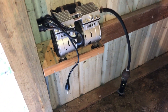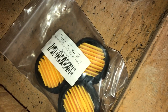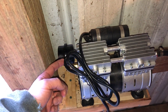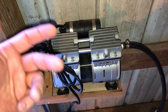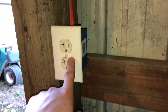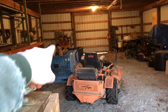The main maintenance I do is this filter housing — it holds little cartridge filters. In the springtime I open the housing, change the filter, and squirt a little air-tool oil in to lubricate the cylinders. Then I leave it running 24/7 all summer long. I plug it in early spring when the water starts to warm up and run it until I unplug it in the fall when the water cools down. It plugs into this outlet — I'm using 10-gauge wire to be sure I'm getting plenty of power, and it's the only outlet on this circuit so I don't overload it.